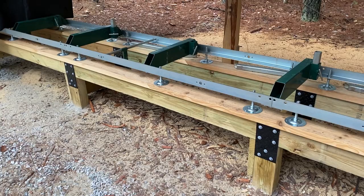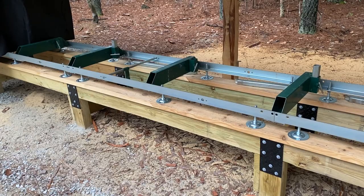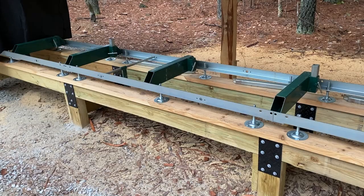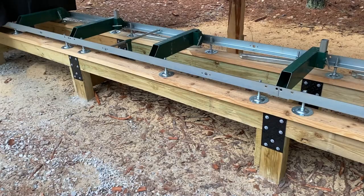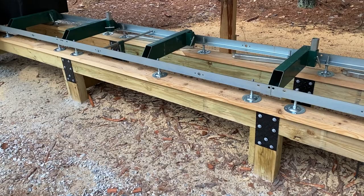This is the same technique I use when I build stairs and decks. I will actually frame up the structure with the posts just hanging down dangling in their holes, and the structure will be temporarily propped up with other lumber. Only when I've got everything framed, squared, and I'm happy with it, only then do I pour concrete around the posts. It's just a good way to do things.